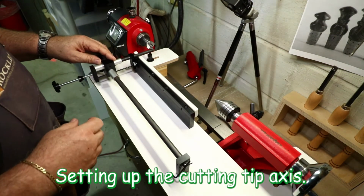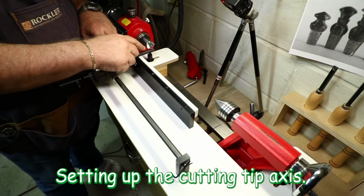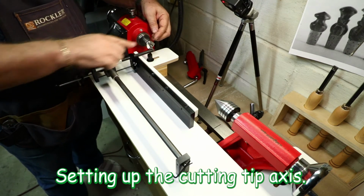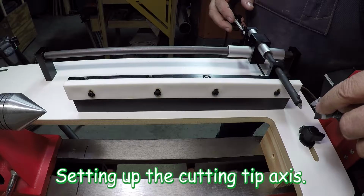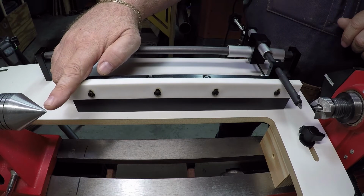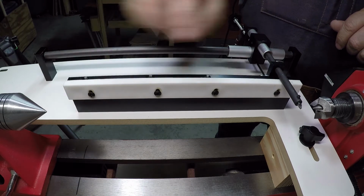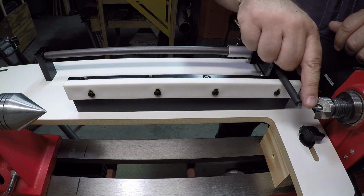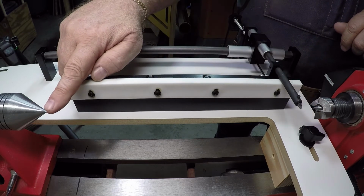Okay, at the lathe here, we're going to set these vertical adjustments and the horizontal adjustments, basically going in and out, so they line up with the tips on this headstock drive spur and the tip of the tailstock live center. I want them both to line up both vertically and horizontally to the very point of these two points.